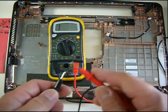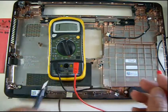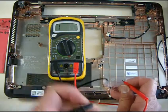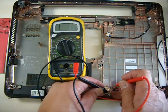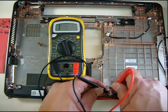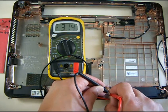Some digital testers will make a sound. Now we're going to trace — put either the black or red probe to either the black or white connector on this speaker. I'll squeeze it just to make contact with the gold connector, making sure not to touch both probes together. If you take a look at the reading, it says 10 ohms.